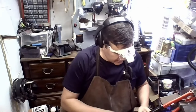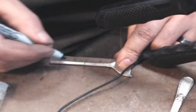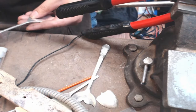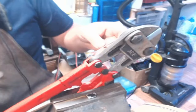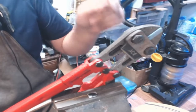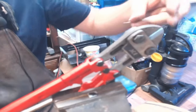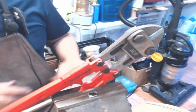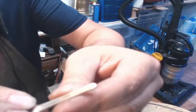For the teaspoon, from the top of the tail: one inch, one and a half, two inches. I'm going to say by eyeballing it we're going to want the one and a half inch mark. Always keep the piece that you want on your side of the cutters. Now we're committed to this measurement. Real quick to the belt sander - you can use a file too - I basically just took the edge off.